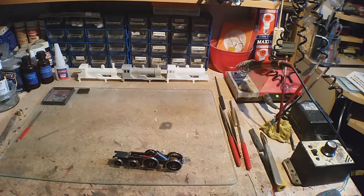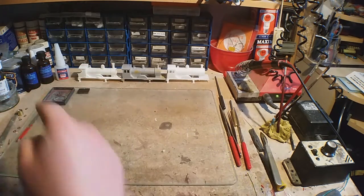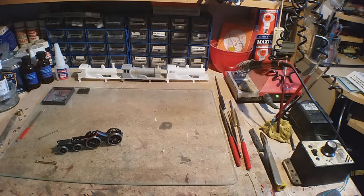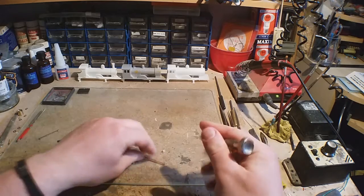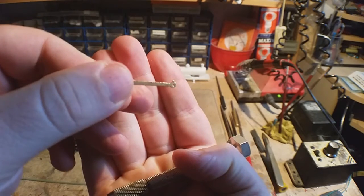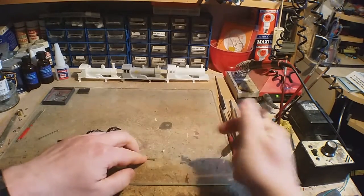So, just to be sure, these crank pins are threaded with Alan Gibson's. You have to put the bushes on. They screw on. And that means they're 1.5mm wide, so you want 1.5 and maybe a tweak of clearance for these holes. So basically drill the holes out little and often. Just keep testing it. And also you'll notice one side is flush and on the other side the boss is more pronounced, so you want to drill this way, ideally, so you don't bend it.